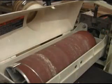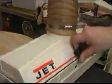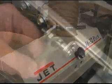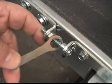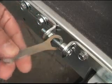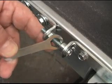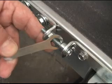The hinged cover over the sanding drum is actually a shroud for dust collection that has a 4-inch diameter port molded into it. While the tracking of the belt is largely automatic, they do include adjusters with these captured wrenches. There's one on either side. It makes compensating for belt stretch real easy, and you don't have to find a tool to do it.